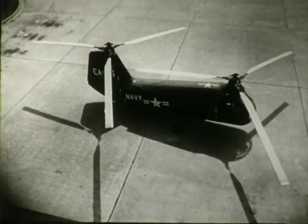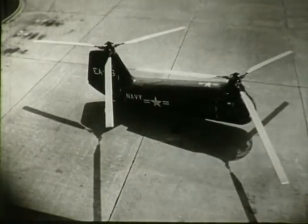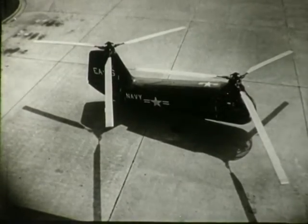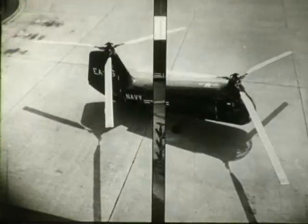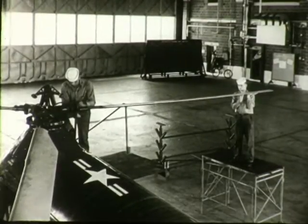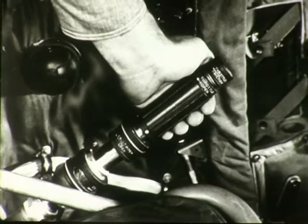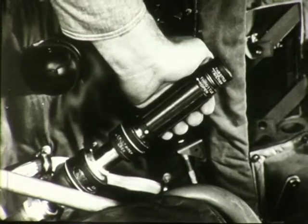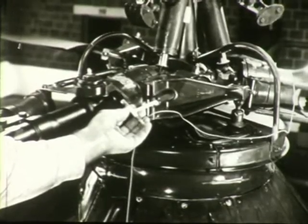It is recommended that blades be removed while in the unfolded position. This will prevent the possibility of damage to the pitch control arm should the blade be dropped while still attached to the arm. Support each end of the blade during removal. Set the collective pitch lever in the neutral position, and make small adjustments up and down to assist locking the pitch lock pin as it is pushed in.